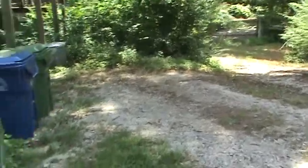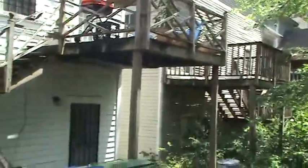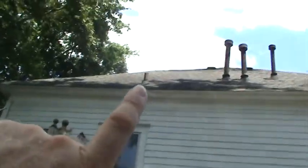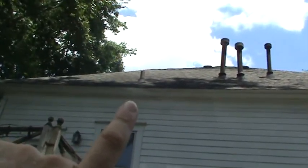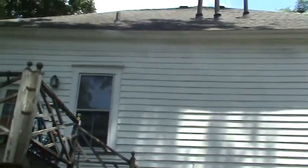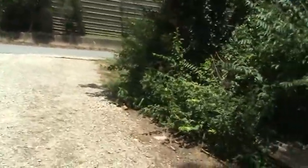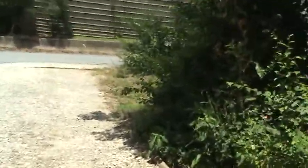Happy to show you some things — the videos help for the owners so they can actually see what's going on with this stuff. Most of the wood on the deck is great and it's solid; these four by six posts are in great shape. The one thing we noticed while we're here is they've replaced this vent boot on the back of the house at some point, and every time it rains the water's getting right underneath it. Don't use those plastic boots — we use the metal ones, they last a lot longer. But that just needs to be secured and nailed. I'm Andy with HandyAndy Handyman, 770-912-2829, handyandyhome.com.